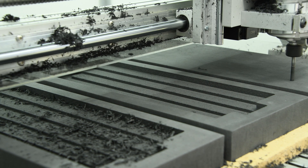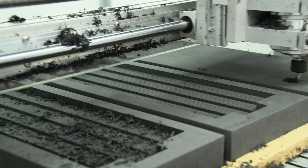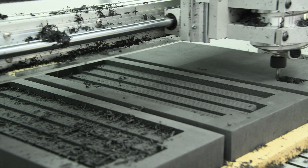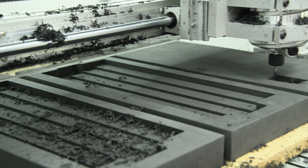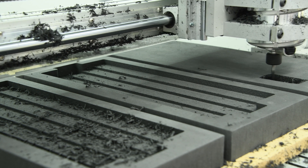Second, we could skip the 3D adaptive altogether and use a 3D pocketing operation. I honestly liked the pattern that adaptive milling left on the floor of the foam, but I don't think there's any particular reason you couldn't just use pocket clearing here. Adaptive clearing is useful to make sure you don't put undue stress on the cutter when it digs into corners, but we're milling foam, not metal, so we might just pocket next time.